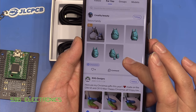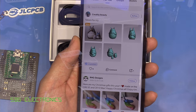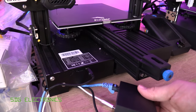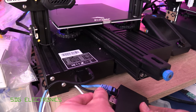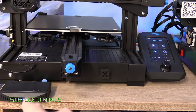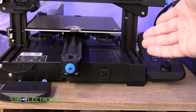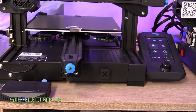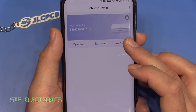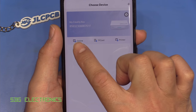It requires you to install the Creality Cloud app, which I've just done — you can install it from the Google Play Store or the Apple Store. I'm going to use the ethernet connection since the wireless switch is just down here. We'll plug that in, connect the USB cable going to the Ender 3, plug that into one of the USB ports, and then plug in the power lead. The setup is pretty straightforward — all you need to do is scan the QR code on the back of the Creality box and follow a few steps on the app, and it's pretty much done. It says it's online.